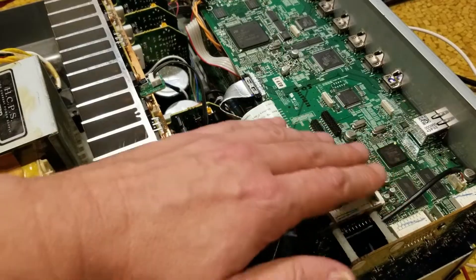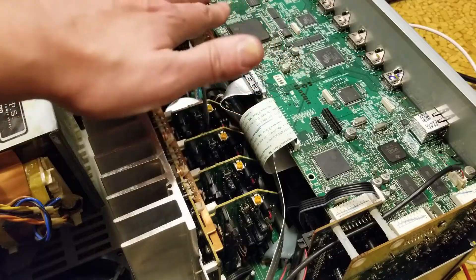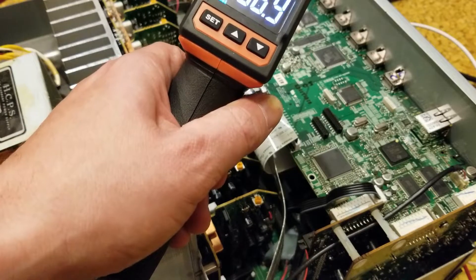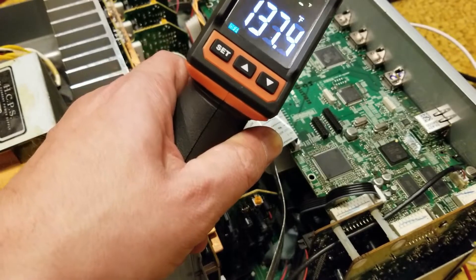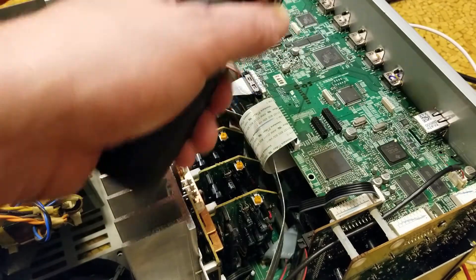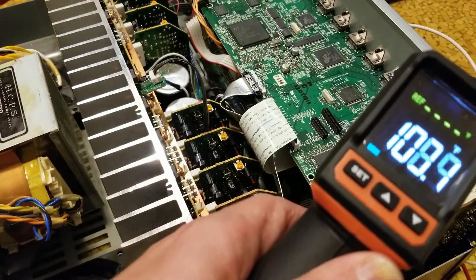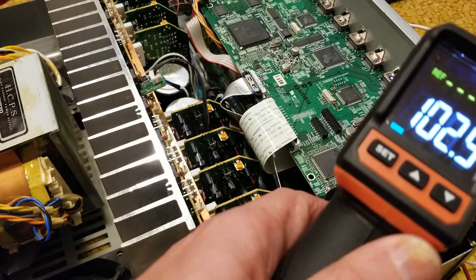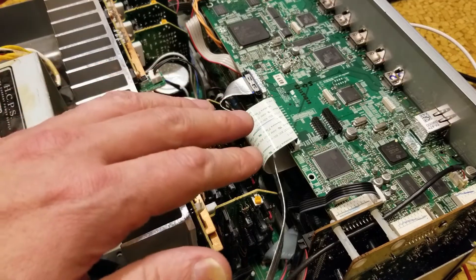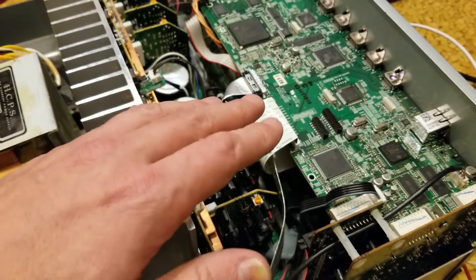The last thing: we've got to find some kind of little piece of aluminum to keep these chips cooler. That chip is almost too hot to touch — I did just touch it. Getting it at the right angle here, look at that: 138 degrees and it's running in direct mode. One last measurement on this other chip: it's already climbing towards 105 degrees. Really kind of a shame — heat sinks alone could have prevented a massive amount of all these problems Onkyo had.